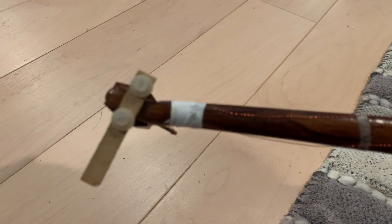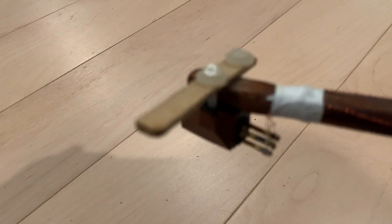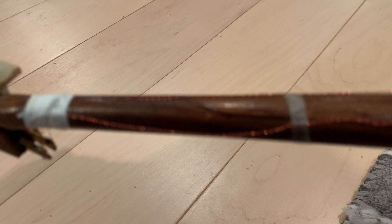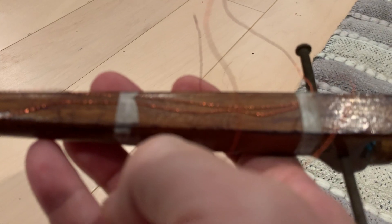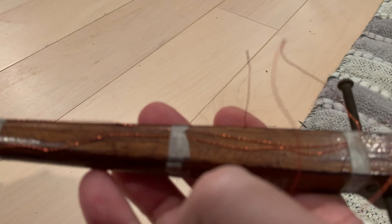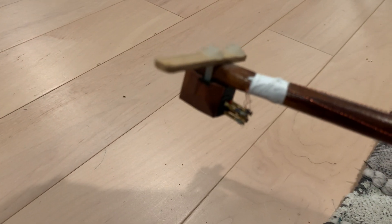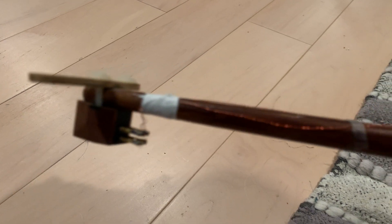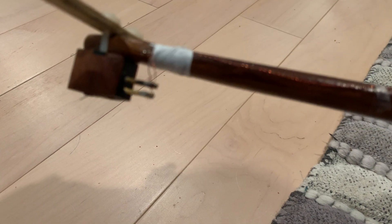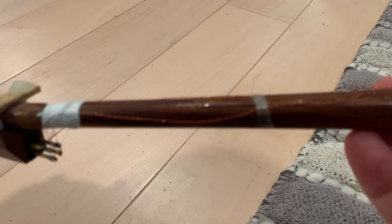So now I'm just showing this arm because I'm going to rewire it. You see there's that tiny wire, barely visible, running from the connections along the body. First it's held there by the teflon wire, and then there are pieces of parafilm, and there it exits the body. I just cut it off from the base. The wire here is gauge 34 magnet wire — that's copper wire — and they are twisted pairs per channel. I'm going to change that for silver wire, but I have bare silver wire, so I will do something different. I'm not sure how it will work because the surface is already painted, but I will do some experimenting and share with you.